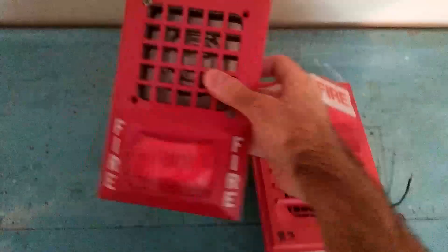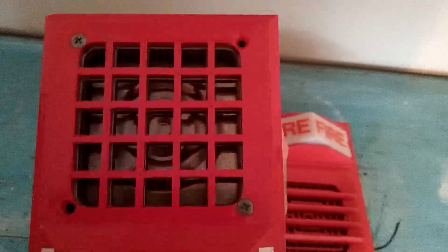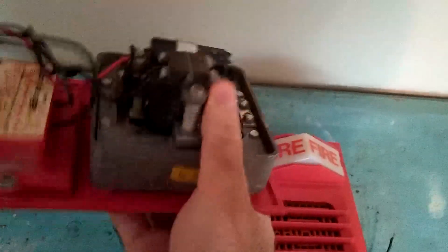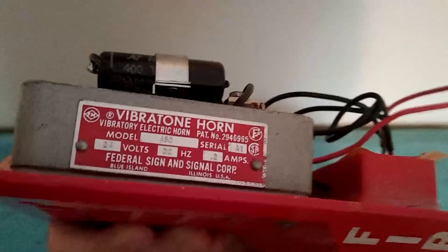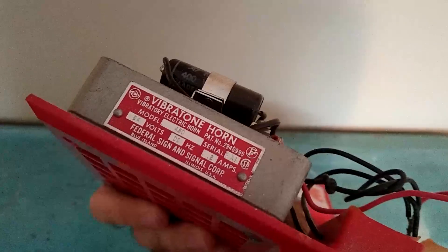This one is connected to my Space Age Electronics AV32 light plate, a very old one, and is silver. They also made these in red, but this one is silver. As you can see, the grill is quite open — it does have that round perforation. The earliest version actually was completely flat on the sounder plate. You can see a giant capacitor here and a massive electromagnet in the center. The current draw on this is massive as well. You can see from the tag — a nice, beautiful all-metal tag — the current draw is a full 200 milliamps, or 0.2 amps. That might be due to inefficiency, but this thing is also extremely loud, probably the loudest of the four.